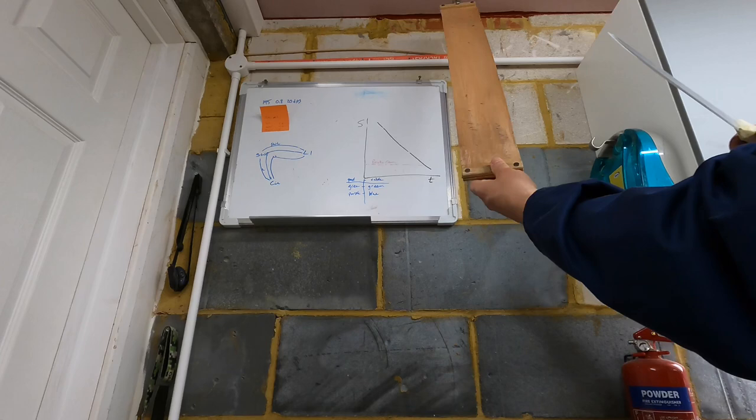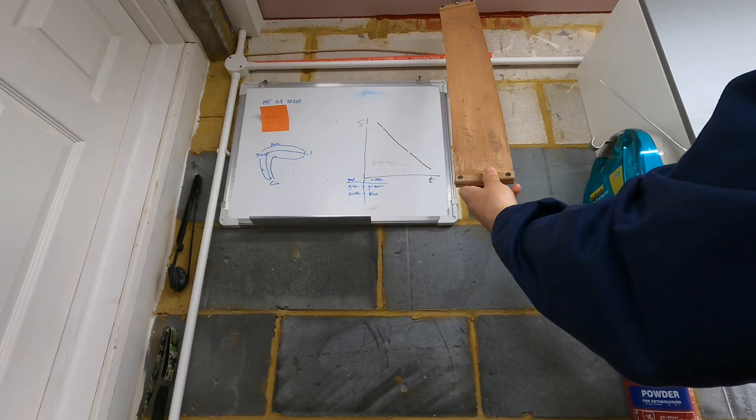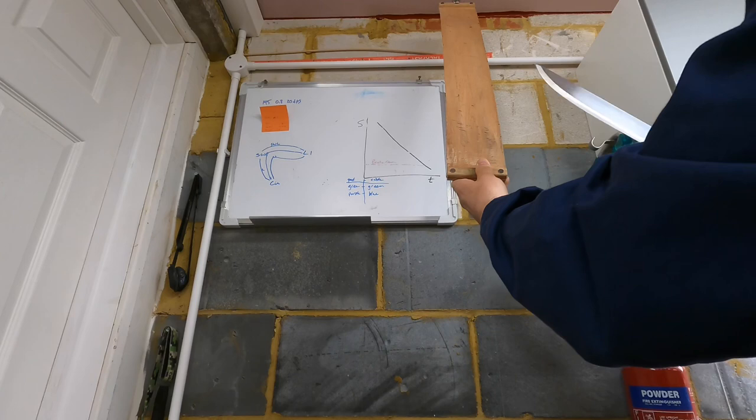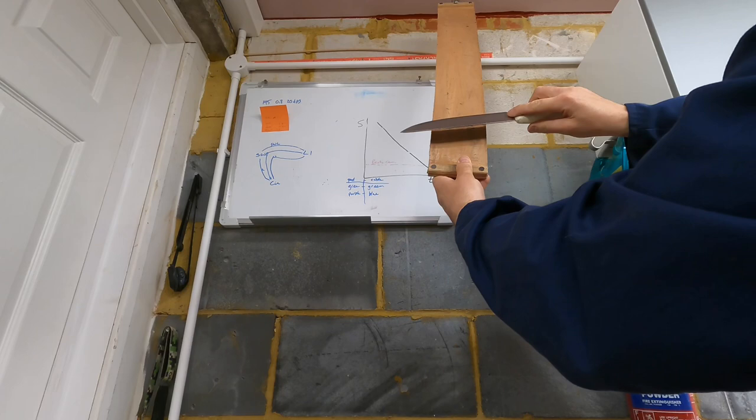Okay, hanging strap here, made from kangaroo tail leather. I bought this from Vadim Krychuk of Knife Grinders. Unfortunately, he passed away not that long ago, so these are no longer available. I don't know if it's useful to share how amazing I think these are, but it's a tremendous finishing tool for sharpening. We use it on everything that I do, whether it's Tormek or WorkSharp. I'm gonna do 20 passes, 10 per side, so up on one side and then down on the other.